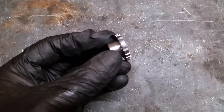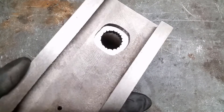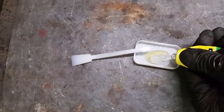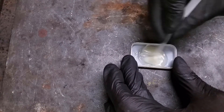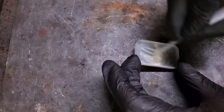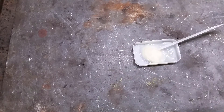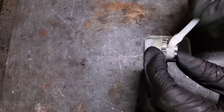A quick look after filing in all the grooves. I am using a two-component epoxy glue. This glue is really strong and will lock the insert inside the top slide and prevent it from turning. At first I was thinking of machining a press fit, but this comes with a few cons. A press fit will add additional stress to the top slide, and because it's cast iron I don't want to take any chances in cracking it. And if I need to remove the insert, a press fit will be a lot harder to remove than the glued version — I just need to heat the part up and the glue will crumble.